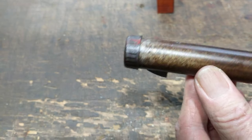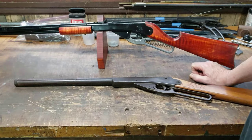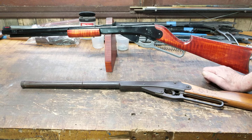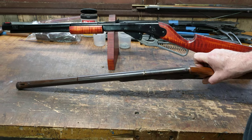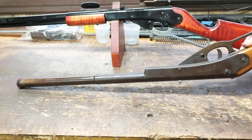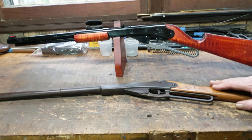I'm believing that this was originally one of Daisy's nickel-plated guns. Although if you start looking into the history of the piece, you'll find that way back, Daisy did not have good success with traditional bluing techniques, so they had perfected something they called black nickel — which is a nickel coat with an oxide on top. It looks dark when it's new. In the collecting field that loves this model, people often talk about how folks polished their black Daisies so much that they got shiny, because there was a nickel coat underneath that oxide layer. Overall, good solid gun — I'm sure the client will have fun with it. It's up to speed and running again.